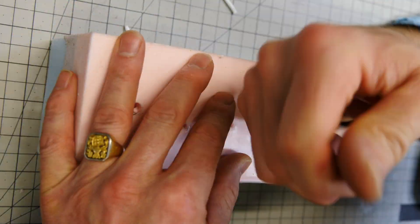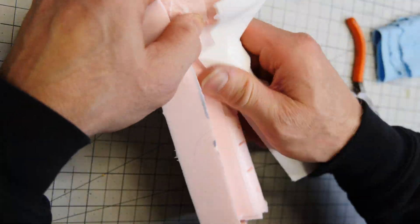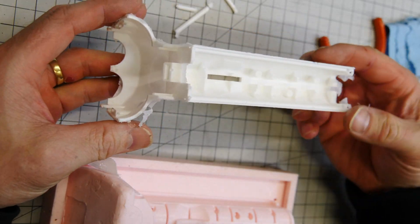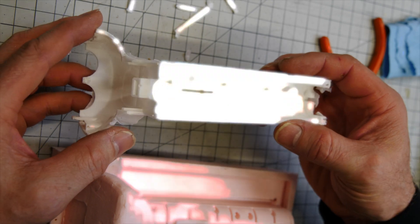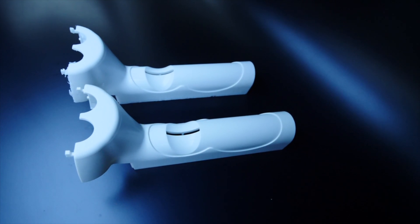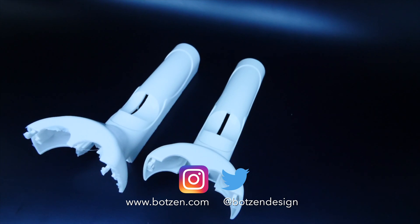You can see how much easier these pliers work to pull all the vents out of the silicone — it works great, very pleased. Let's pull the part out. The soft silicone is working pretty nicely for some of these undercuts. There's a little bit of flash that's pretty minimal, but the detail parts all came out — little holes on the end and the little pins in the front. Not too bad. There's a tiny air bubble on the bottom, but not too bad. I need to go make seven more of these. Hope you enjoyed the video — good luck on your casting projects. Make sure you give the video a thumbs up and subscribe if you haven't already. Hit the bell so you get notifications, and don't forget to follow me on social media — Facebook, Instagram, and Twitter — links in the description below and on the channel page.